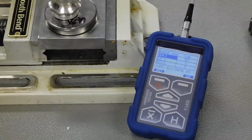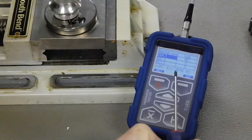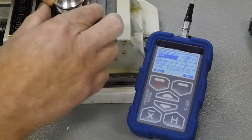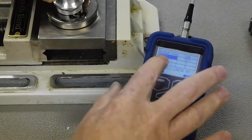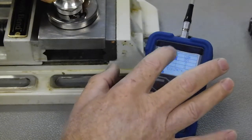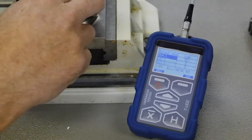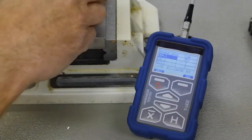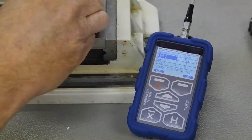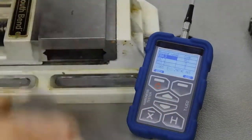It's telling me this first test — the code is not important. What we're really looking for is to see if it changes dramatically. This code is stored in the device and in the probe as a record of what this particular manufacturing was and what that code value would be, to do another check anywhere within a range from a little bit greater than 64 right down to a little bit lower than 23. We can test any part of the like material. I do another test here and I'm watching the code value to see if it changes dramatically — and it hasn't. I want to do a minimum of three or four or five. That's done. I take this one off.